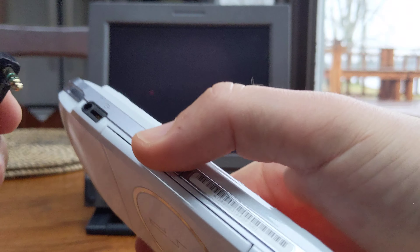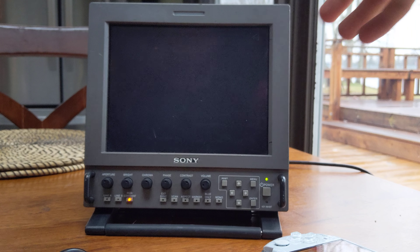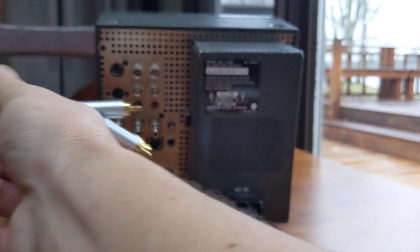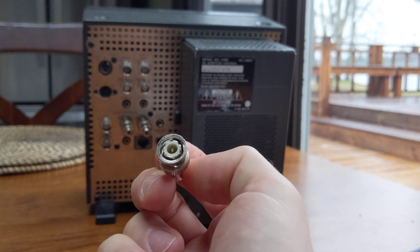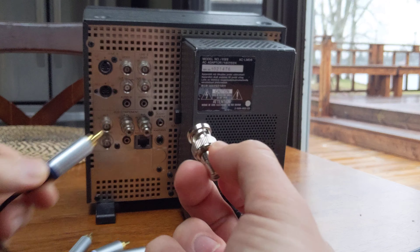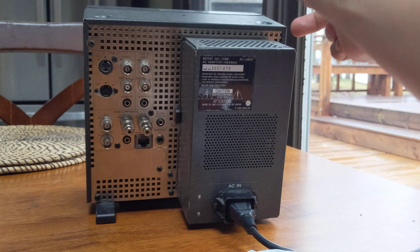So we hook up this connector right here — in the camera — and locked. So now we've got to turn it around. We basically just have everything we need right here. I use BNC adapters. These are BNCs. Obviously, we need these because we can't hook up RCA into here — it's not the same connector. This is a BNC to RCA converter coupler, which allows it to connect.